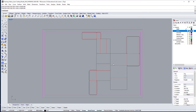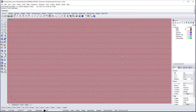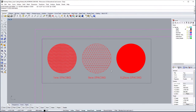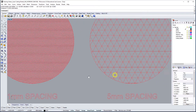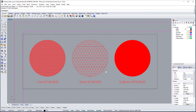Directions on how to identify and eliminate duplicate and overlapping lines has been covered in video 3.01 from the previous chapter. Another strategy is to understand the level of detail in your rastering and etching, as the laser cutter will only produce line work to a certain resolution. Therefore, reducing the rastered or etched line work in your file to the simplest level possible will significantly reduce the laser cutting processing time and save you money.